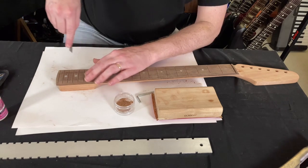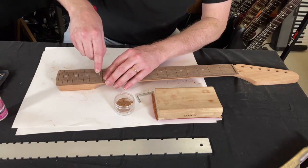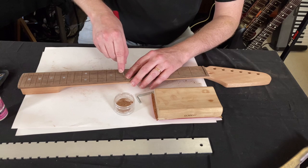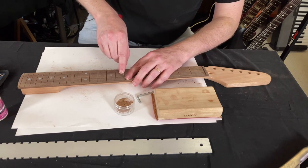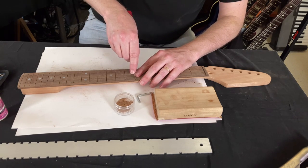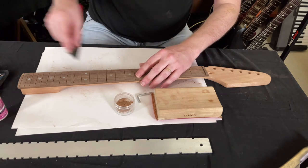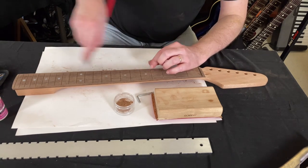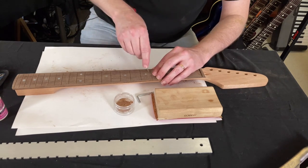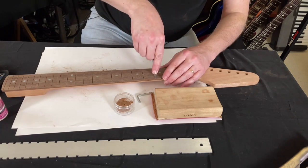See how I'm getting it out? I'm just clearing the wood dust out — I'm not cutting these slots any deeper. I was calling it sawdust, but wood dust is probably closer to the mark. How deep are these slots? That's an interesting question because the frets I have are a certain depth. If these slots aren't deep enough for those frets, I'm going to have to go in and cut them deeper. I've got white paper under here to salvage some of this stuff — always good to have.